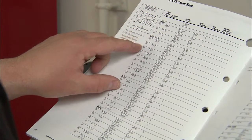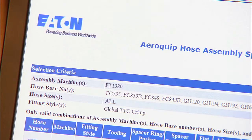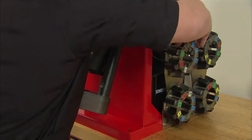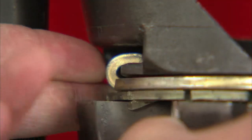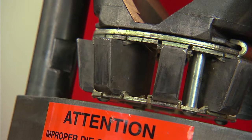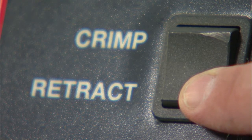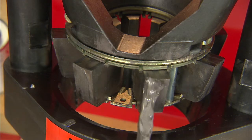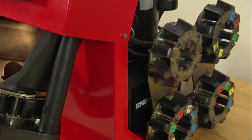The proper Eaton tooling must always be selected. Refer to the published Eaton Aeroquip crimp specifications or download them from Eaton's website. You must select the correct die cage and crimp setting for the approved hose and fitting combination. Inserting the die cage is easy — ensure that the power switch is in the off position and then slide the die cage onto the two grooves in the holder. To load or unload the die cages, the crimp ring must be in the fully retracted position. If the die cage is not fully retracted, press and hold the retract switch until the crimp ring stops. For the first time and periodically thereafter, lubricate the exterior taper of the crimp die with the Eaton anti-seize lubricant supplied with the machine. Optional die cage holders are available and can be mounted to the side of the unit.